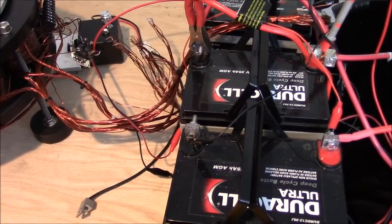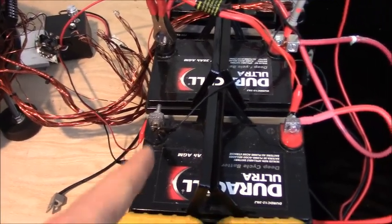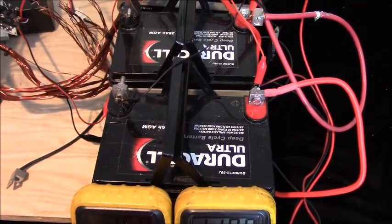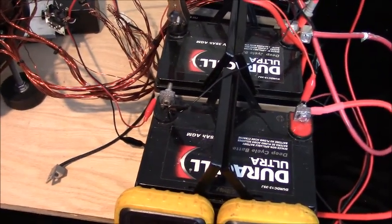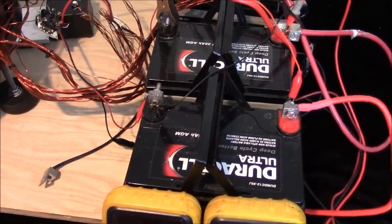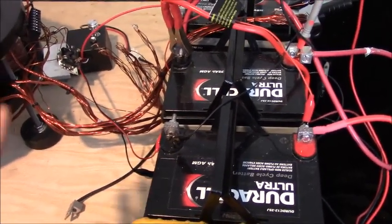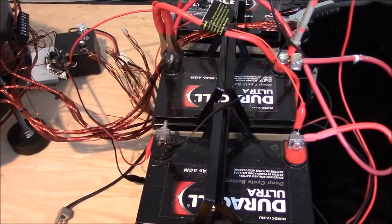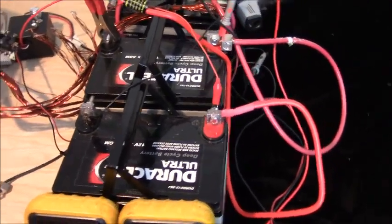So anyway, what we'll show in the next video is this MOSFET here driving the bigger batteries. A typical system for this I'll show with the golf cart batteries. These are only 35 amp hour batteries. So then what we'll have is 12, 24, 36, and 48 volts with the 4 MOSFETs on there. And then I'll do the water cooling, because the water cooling will be provided with the assembled kit. The unassembled kit will be everything but the water cooling. It will still have the heat sink, but I won't include that with the unassembled kit, because it's going to go over my cost price.